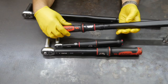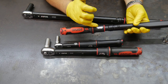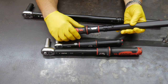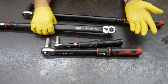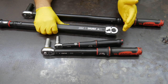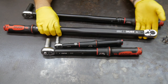You don't have to do any conversions, and there's a nice magnification window where you can see where the red line is on both newton meters and pound-feet. They have that on all sizes of the ratchets, going all the way up to one-inch as well. There's a directional lever for on and off, but keep in mind that most torque wrenches are only certified or calibrated for one direction — typically clockwise rotation, for tightening.